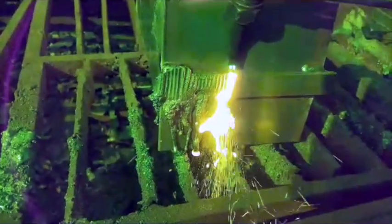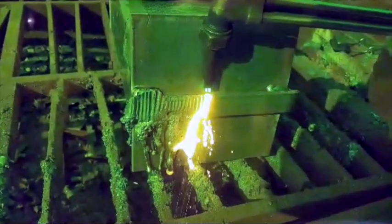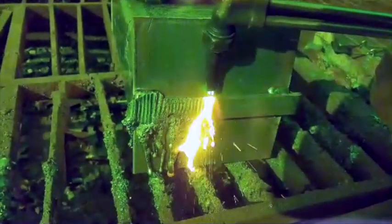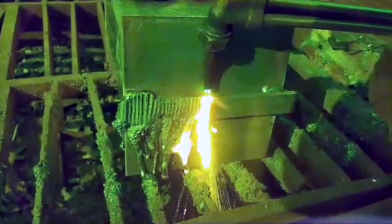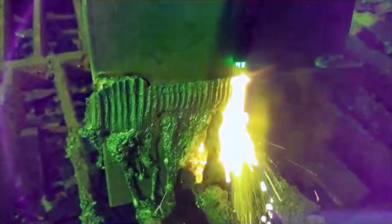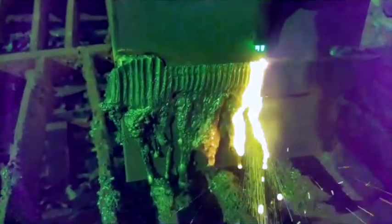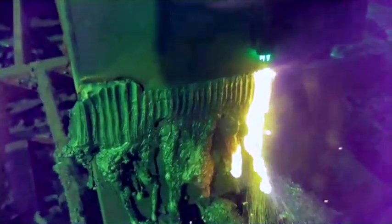The idea here is getting rid of as much metal as I can so I'm not grinding forever, while trying to avoid gouging into my base metal. Many a welder has done a nice job on a weld and then gotten in here and drifted into the back of his metal and made a mess. So I'm just going to watch up top here — I'll see it break down and I know it's coming in.